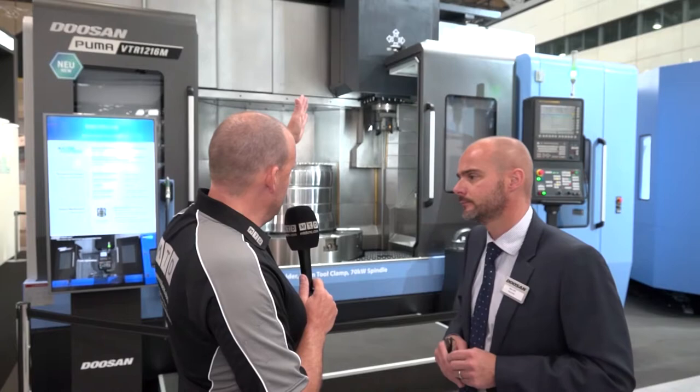On the column you've got the Z-axis. Has it got a W-axis too so you can bring the RAM down? Yeah, it's a W-axis. The W-axis will clamp at every 200 millimetres because obviously you want to keep the RAM extension as short as possible for that heavy-duty cutting.